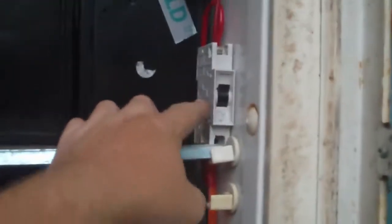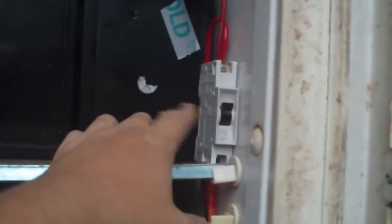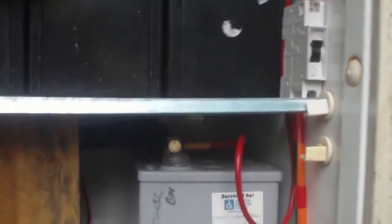Obviously these being gels, I do not need it on those, so they are connected in after the inductor. And this breaker, incidentally a 20 amp AC breaker, which I have every confidence in will continue working fine. In fact, this breaker will probably outlast anything else you see in here, including the fridge. It'll still be working long after everything else is stuffed. So from there it feeds down here into the main bank, and of course a negative over here.